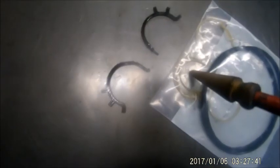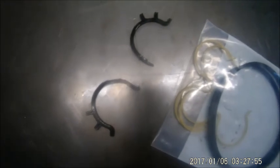Okay, we took our pump apart, it would only make 1,000 PSI, and we found a seal in there failed. It's an end plate seal, and it's backed up with a plastic backup ring, or nylon. And they both were split in half. I'm assuming the guy that put it together screwed it up. Luckily, he no longer works here.